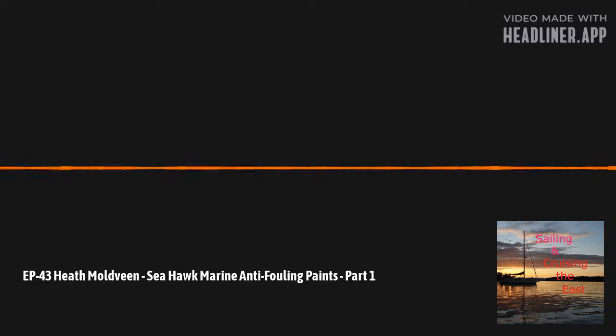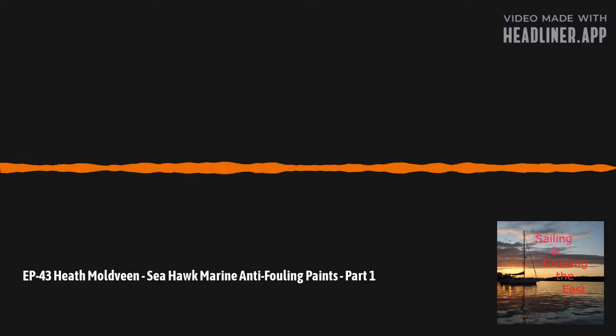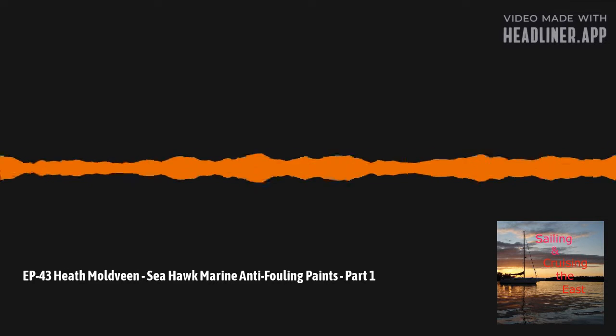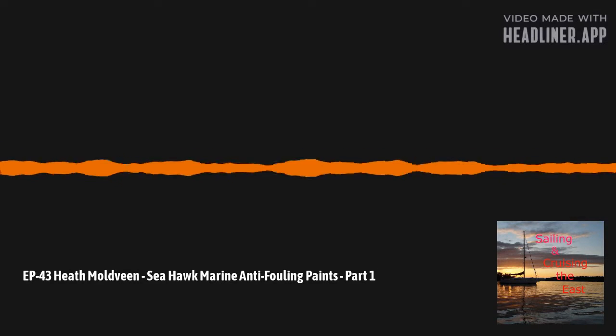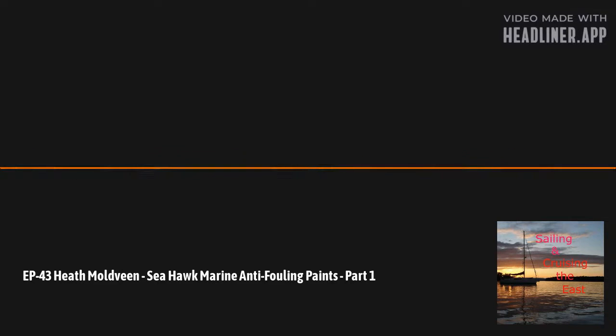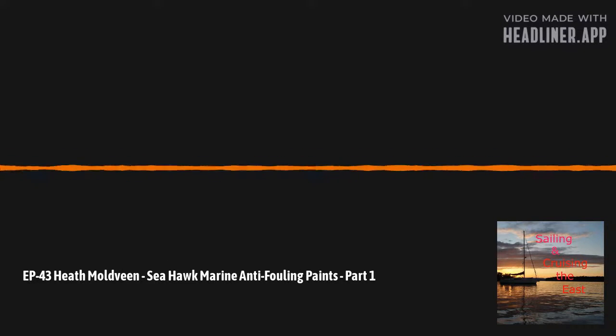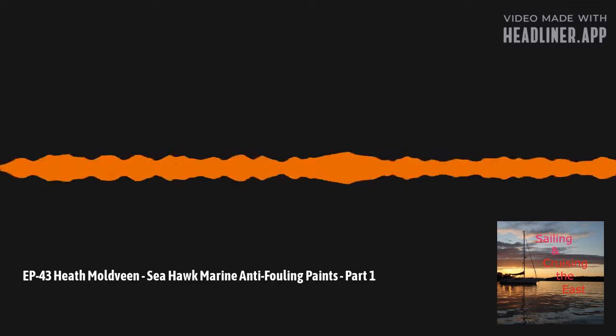What does ablative mean? A lot of people say ablative. What does it mean? It means to wear away, right? So we make paints that are hard, modified epoxies, and they release protection or biocides through leaching. It's a little less controlled, and they work really well at first, and then you have to scrub them to reactivate the surface because you have what's called the leach layer. It's that outer layer of anti-fouling film, which doesn't contain any biocide, but has resin and pigment in it. So that's hard paints.